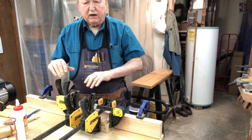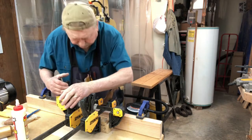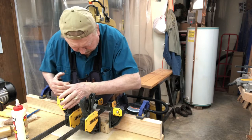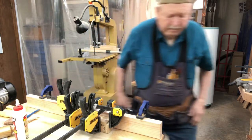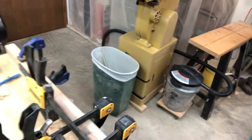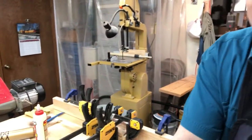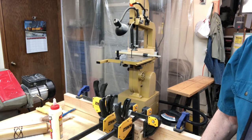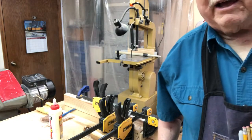The idea here is that we have to equalize the pressure on both clamps because at the beveled edges the piece wants to slip. I'm looking to see if the pieces are coming together. You can see that the piece is glued there — that will stay that way until tomorrow, at which time I'll take the clamps off, remove the excess of the accent piece, and then eventually put that in the lathe and turn it. We're anticipating it should look something like this. Thanks a lot — thank you, Sally, nice suggestion.